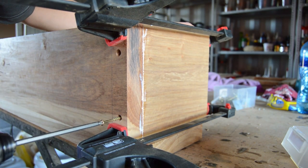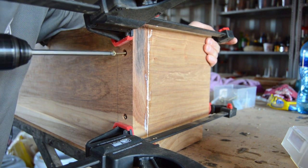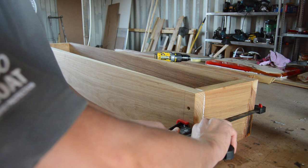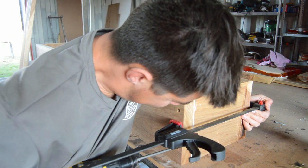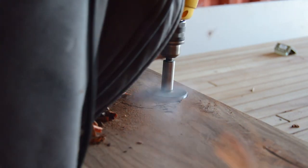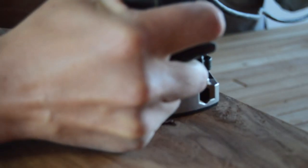I'm clamping all the pieces together and then screwing them. The screw holes I filled afterwards with a mixture of sawdust and wood glue, applied into the hole and sanded smooth. On the top of this unit I also cut a large hole so that if my client has appliances on top, the cables have a path to run through — then I gave it a small chamfer.